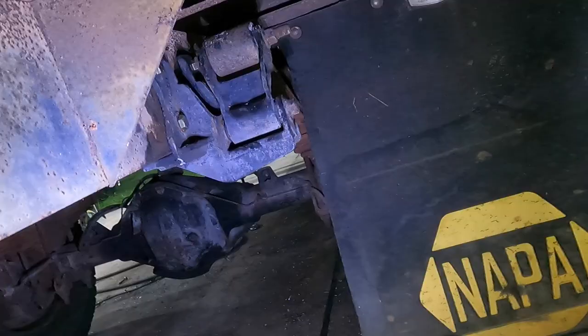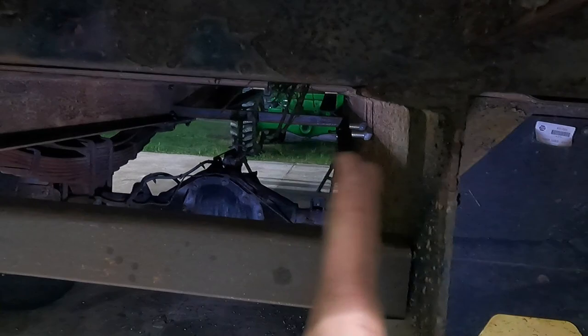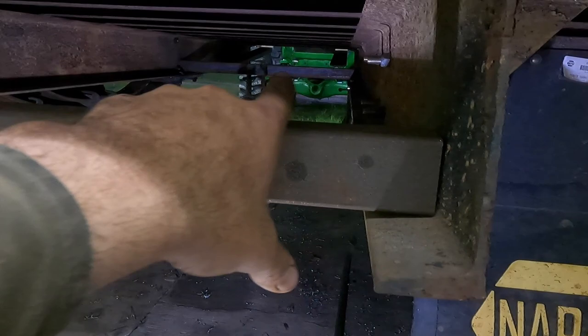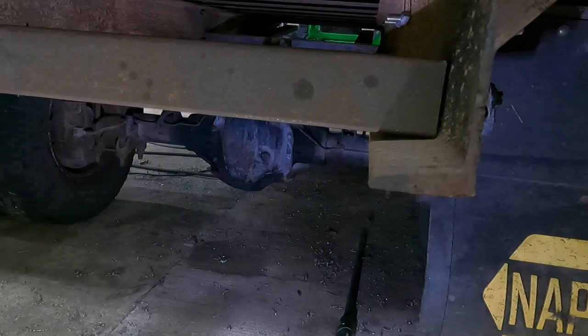So looking pretty good under here. As you saw, I think I added in a cross member because there really is no way to keep this lower channel from moving. This was a bed that sat on top of a frame, so there was no structure to this. I put one right in the middle of the hangers in the front, and put this one in the middle back here. Then I'm gonna clean up first, and depending on what time it is, maybe we'll start cutting the neck and getting that on, but that might be for a different day. We'll see.